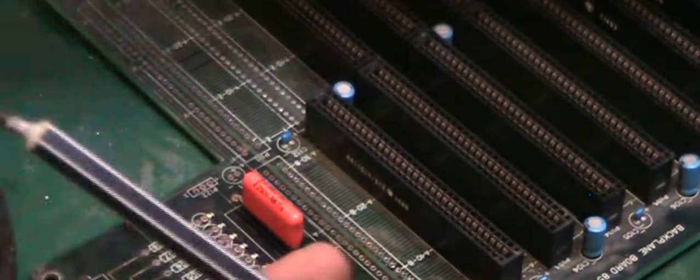So you can see there's basically the repair. And we will know if it's worked if I take the probes here. Let's get, oh, it helps if I switch the meter back on. There we go. And if we go up here where that pin starts and we touch it on the leg of the capacitor, there we go. So basically we have reinstated that little break there, that connection.